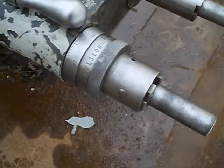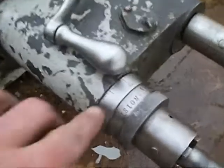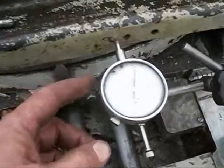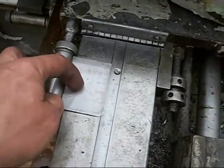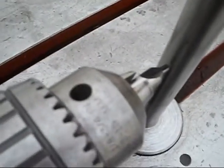There's a vernier scale here, and then on the crank handle it's two hundred and fifty thousandths per revolution, so each one revolution is a quarter of an inch. And in between lines is four thousandths, so that gets a little tricky. So I did it this way with my dial indicator, so I knew what I was doing for sure. And then I could double-check with my vernier caliper or my vernier scale on this side to get me centered to the table with the spindle.